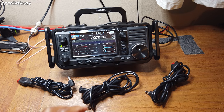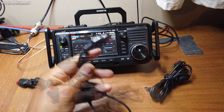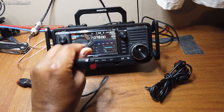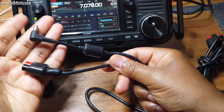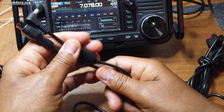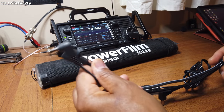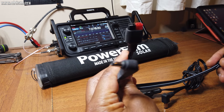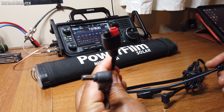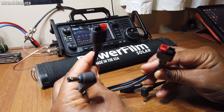Going back to those cables — to make them, I purchased several ready-made cables off of eBay and chopped those up into the configuration I wanted. The reason was to get a molded, robust, and reliable coaxial plug for the ICOM IC705 and the PowerFilm Lightsaber Max. The benefit is the molded connector and the gauge of the wire, which can handle the full 5 amps the Lightsaber Max can provide. I'll leave a link in the description for these cables.